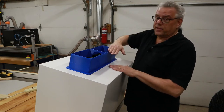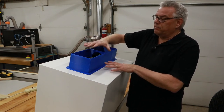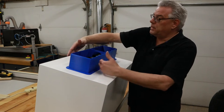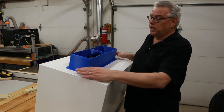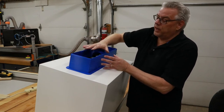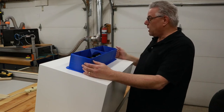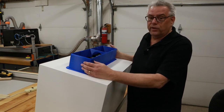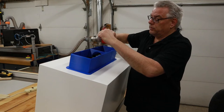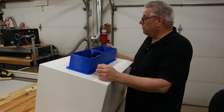Then this port will pass through that board, but to help make sure that it's a little bit more compliant, meaning that I might not be able to get this always the perfect distance to that board, on that board will be another port just like this, slightly larger. This one will slide into that one. And that way it'll be fairly well sealed all the way around, and the exhaust air will go out and stay out rather than leaking through the sides. Perhaps a little overkill, but I'm trying to do it better than what I had before. The other thing nice about this system, all the fans exhaust directly out. There's nothing to impede that airflow from here to the outside environment.